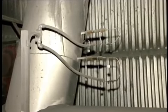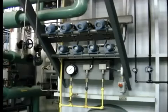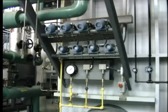Further instrumentation is required for monitoring boiler emissions and other environmental factors. We'll be discussing this in the next module. No doubt on your boiler there are many other monitoring locations. You must learn where all of the sensors are located and the significance of the information provided. Measurements are performed by appropriate pressure, temperature, or flow sensors.